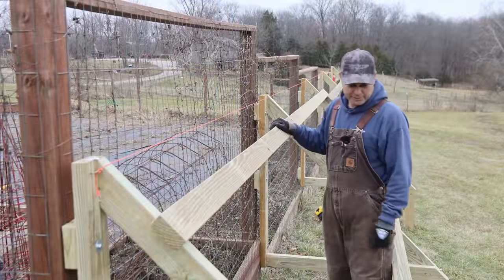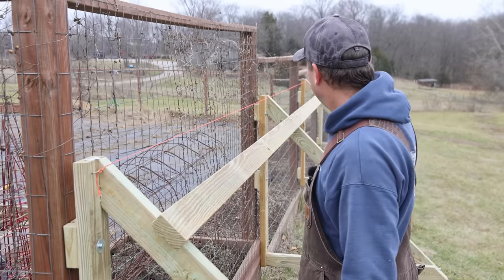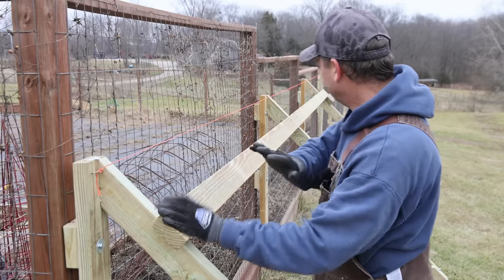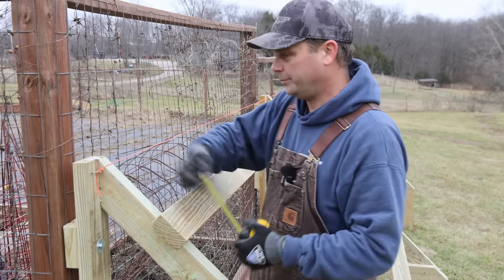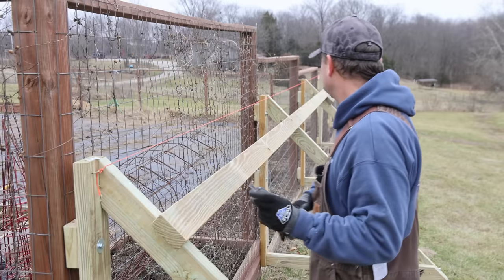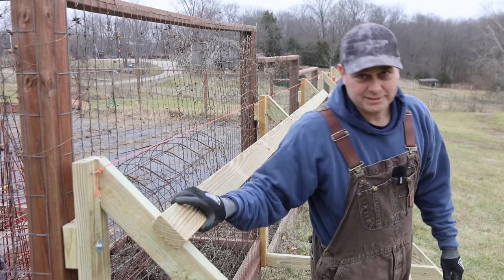I think I've got the ground mount complete now and I'm ready to start putting on some solar panels. I've already run a string going all the way to the other end — that's going to give me a nice straight line to put my solar panels up against and keep them straight. I think I'm going to put them above the string about four inches, so the top of the solar panel will be right there. I don't want to break these putting them on, so I'm going to go get Rebecca for some help and then we'll start getting these mounted up.